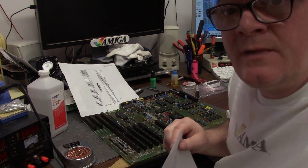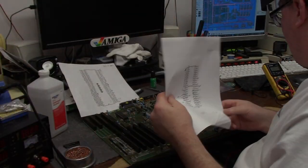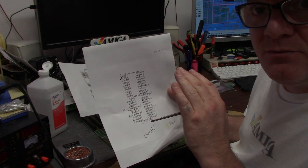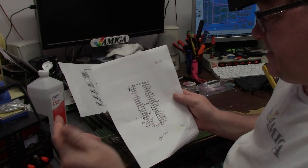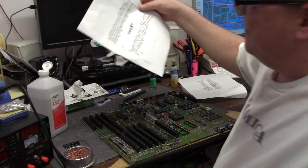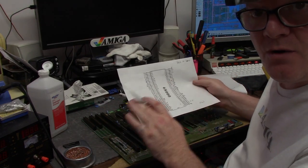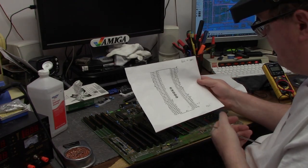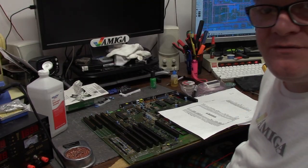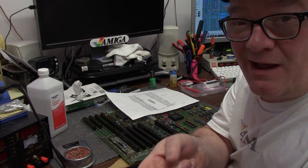It's now 4:38 PM. As you can see by my chicken-scratch writing diagram — that is a lot of wires. That's just the ROM side. Please remember that each pin has two directions. Towards the CPU and towards the ICs, we have 15 bad vias in one direction. Most of the stuff from the CPU going towards the Zorro slots is okay. Everything going to the ROM — hit or miss. 11 so far on the CPU bus from the ROM. It's now 5:50 PM. I've been working on this for an hour extra than I thought.